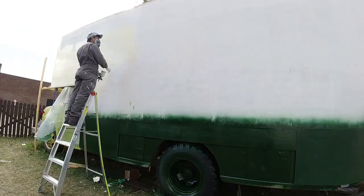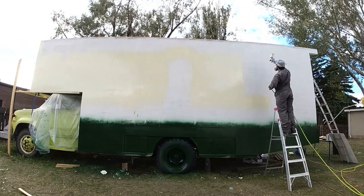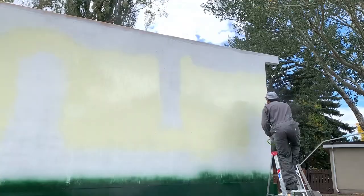The can of paint doesn't have that large of a difference, I would say, between outdoor water paint and the oil-based metal paints that we used. But the biggest difference was that you also have to buy the solvent, the acetone. We also used an isocyanate hardener mixed with the paint, and a little bottle of hardener for a gallon of paint costs as much as the paint. The end result, though, after years and years of being outdoors, will be very evident. The hardener really increases the durability of the paint.